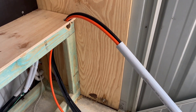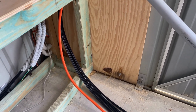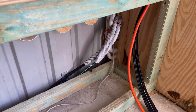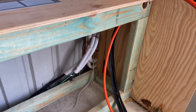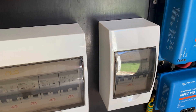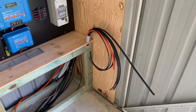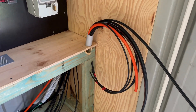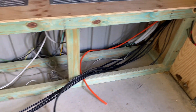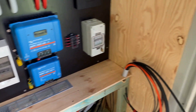I've started to run in those cables — the earth cable and the array cables. I'll make a penetration through the tin and put a gland that'll take the earth cable over to the electrode. The solar cables come up into the top side of the array circuit breaker panels. All the cables are in place and I've added that little bit of conduit to come up into the panel. These cables will swing up into these load centers once I've finished terminating the other end.